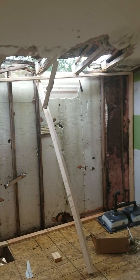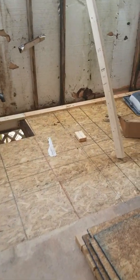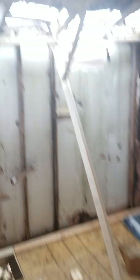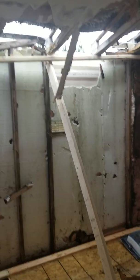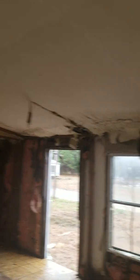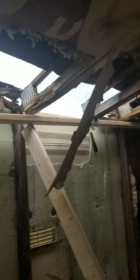Now the roof — I know there's a lot of you guys looking at this going, why didn't you fix the roof first? The reason was there wasn't anything to fix the roof on top of. All of this was basically completely gone, it was all rotted out, and the water damage had just done it. If we would have ripped everything out, it would have affected the structural integrity of the roof that was already there. These roof trusses have got a couple of bad places on them, but for the most part they're not rotted. The fascia board ties them all together but that can be replaced.